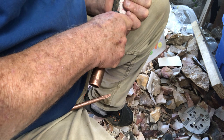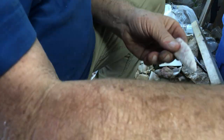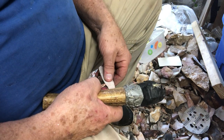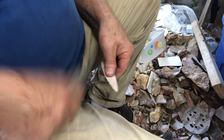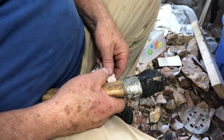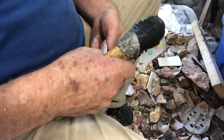I'm just barely tapping this thing, not hitting it hard at all. That billet's so heavy, I'm just kind of basically letting the weight of that billet fall. Alright, got it ground — come down here right on the tip, and this is where you sure enough got to be careful. Got that one. Got that one. Got that one. Didn't get that one, try it again. Slid off of it — slid off of it again. Better be careful. It was not quite below the center line enough for me to catch it good.